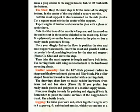An end cleat on the daggerboard seats against this cap when the board is slid into place, with keepers cut from old auto inner tube, preventing the board from floating when the dinghy is in the water. You may want to close the trunk if you use the dinghy with an outboard, in which case the trunk must be closed. To do this, make a plug similar to the daggerboard, but cut off flush with the bottom.